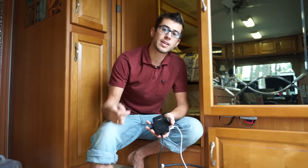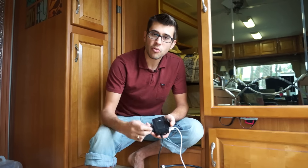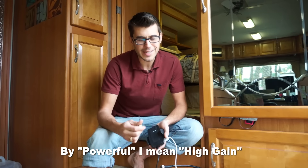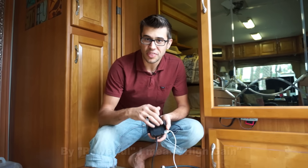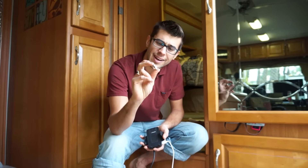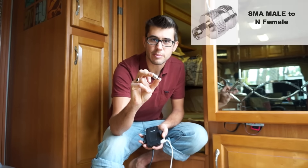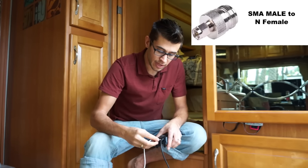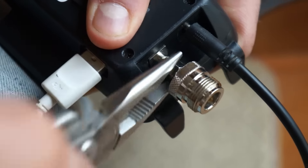What I wanted to do is connect this to a powerful directional antenna outside so that we can get the best possible amplification with this little tiny booster. So what I did is I adapted this to work with a cable and another antenna — I got an SMA male to N female adapter and I connect it to the back of the cell booster just like so.